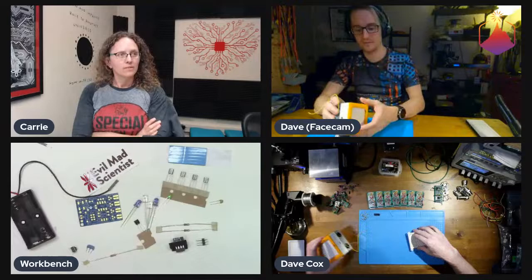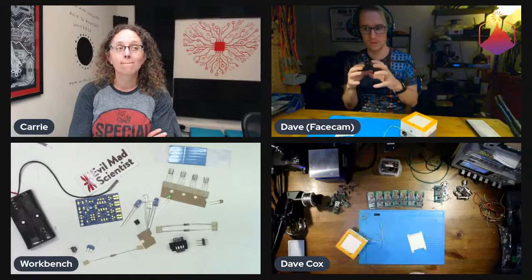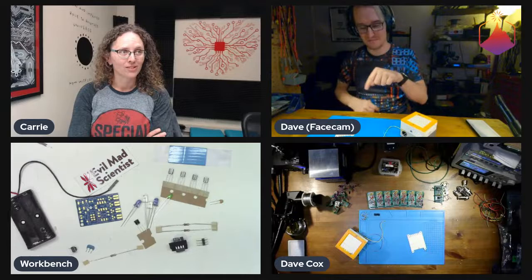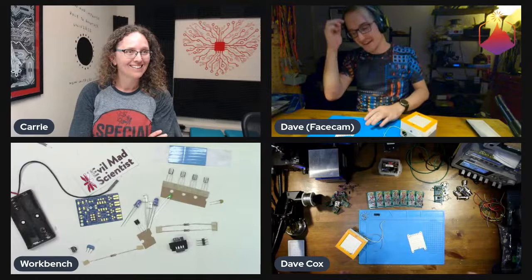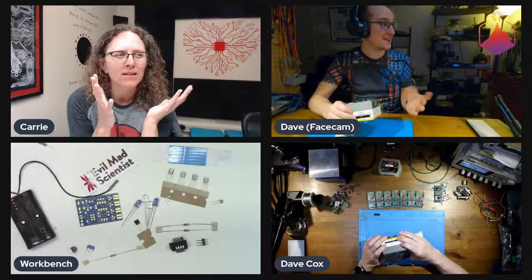So I did a little bit of shopping on DigiKey, found these 95 CRI modules in two colors, did some research, and learned about aluminum PCBs. This is an aluminum board — it's the first time I've done anything in aluminum. I also had sliders from a high-end film mixing board that have a servo controller, so they move to a position. I thought: what if I built a lighting board for my desk? And then I was like, I want it to be DMX so I can tie it into another system. It just led to vastly over-engineering this problem.